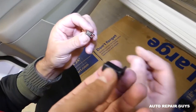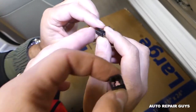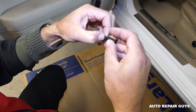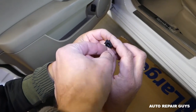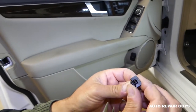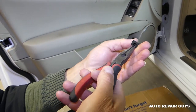It's important to know how to put that clip back together. You cannot push the middle part in from the outside to the inside — you need to go from the inside to the outside. There are two teeth on one side, one tooth on the other, and corresponding canals. When you're ready to reinstall, go from the inside out and pull it with small pliers.